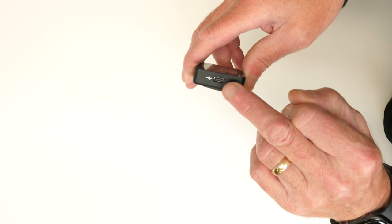If we look at the side of the mic, you can see a USB port — this is where you normally charge it. On the original Wireless Go, this USB port is for charging only, whereas on the Wireless Go 2 you can actually use it to send audio out. The benefit of outputting audio via USB is the quality — it's just so much better, particularly when you're connecting to an iPhone or an iPad. So if you want quality audio, USB is the way to go.